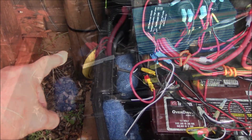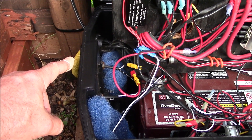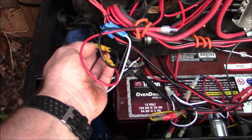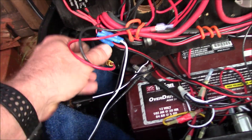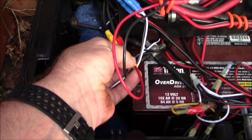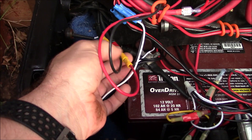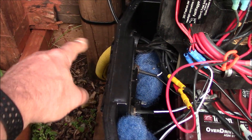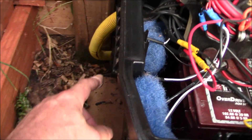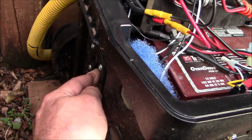Let me show you what I did on the inside. I've got two PV wires wired together in parallel that go in right here. I put some quick disconnects rated for 30 amps on here, so now it's good and solid and protected. If I splash water up against here or on top of the box, it's not going to leak down on top of here.